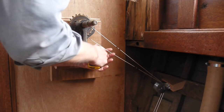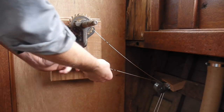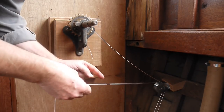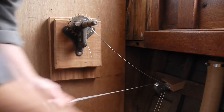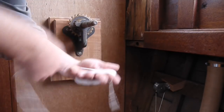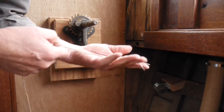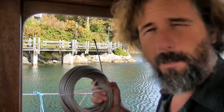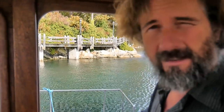It seems very strange to pull this all through now that it's gone slack, but let's do one at a time. Through it comes. This mark here is where I'm going to put the splice underneath the bed, and this mark here is where I'm going to attach it to the quadrant. And now the other one. The bulk of the remaining work is to make up the individual cables out of wire rope. I've measured them all by marking and cutting to length the original string that I've run through the system - now I just have to transfer that to wire rope, put some thimbles on the end, and connect it all back up again.